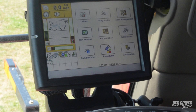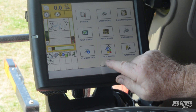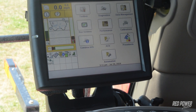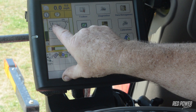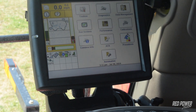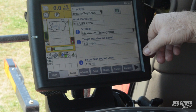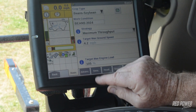Once we've activated the headliner switch and come back down to our screen, we notice something's changed — our layout's a little different. Automation's not there by itself, and the reason is when we activate automation, automatic crop settings gets put on the sideline. If we flip this button, we've got automatic crop settings and automation. You'll notice up here in our little combine we have a number one inside the harvest indicator, telling us we're on automatic crop settings. If we touch our headliner button, it goes to A, telling us we're in automation, and the ACS button is temporarily gone. We start with our feed rate screen — which we've already got set up — and we're on soybeans.